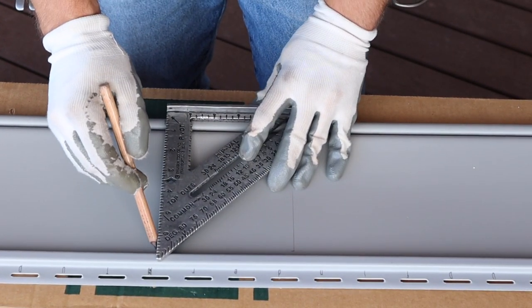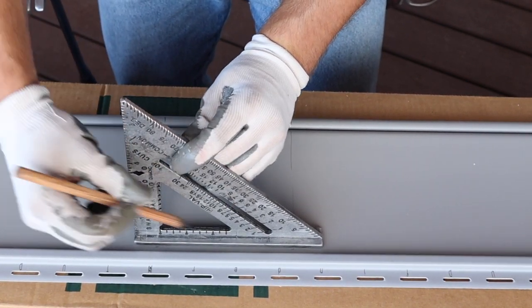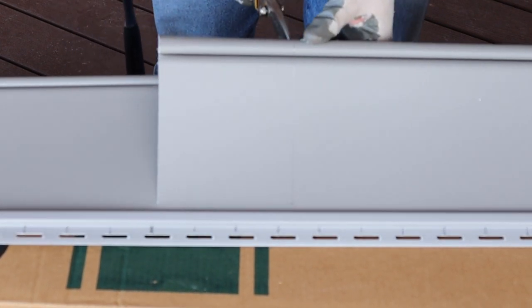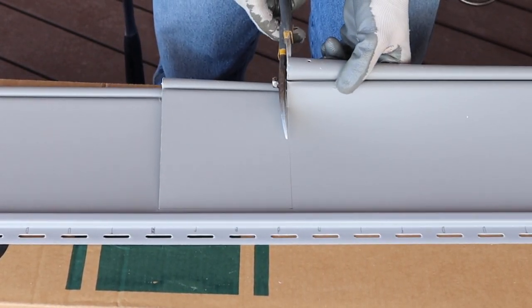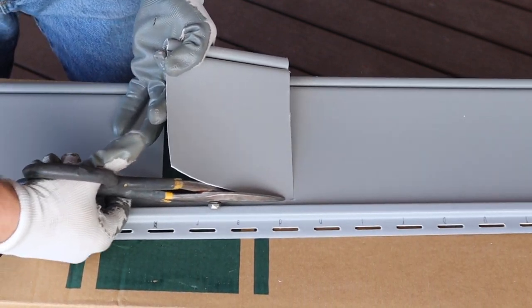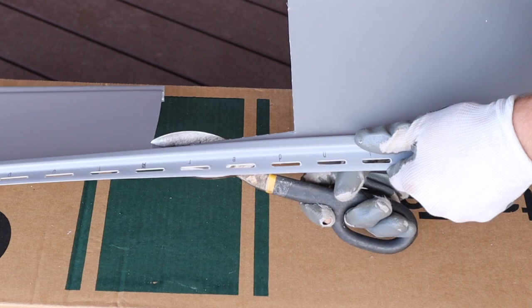Take your speed square, line it up with the marks you made around the E-block, go up to six and a quarter, make a mark, then trace a straight line off the speed square. Use that as a straight edge and mark a line from mark to mark. Then take some tin snips and cut it out. It's warm out today so it cuts pretty easy. When it's colder, vinyl has a tendency to crack when cutting, so resort to a saw — a circular saw with the blade on backwards, a grinder wheel, or an oscillating tool.